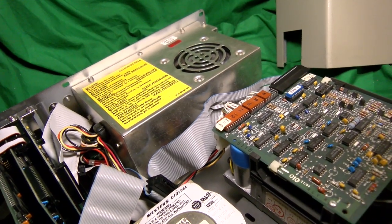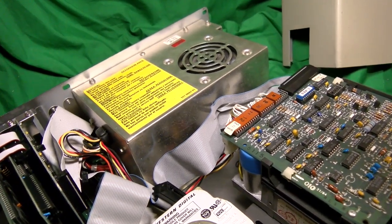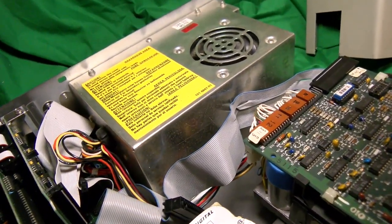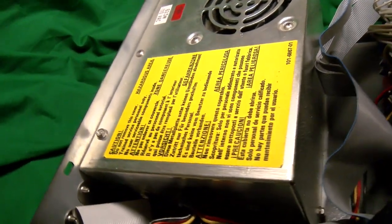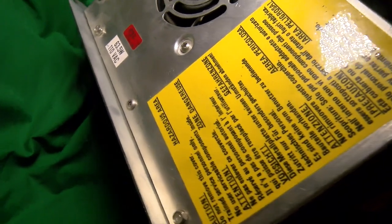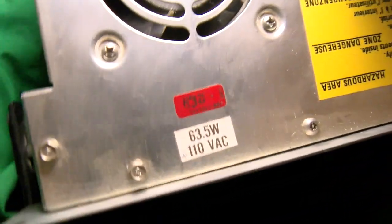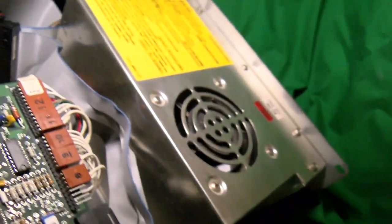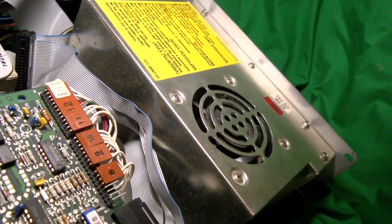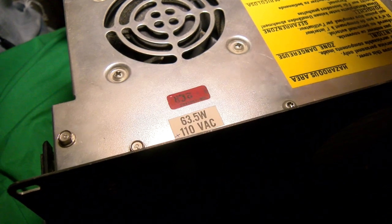And immediately, we're staring at the IBM-style power supply. We didn't get the smaller AT-style power supplies until quite a while after the XT, and I can't remember ever finding out who did them first. As well, we call them AT power supplies, but the IBM 5170, which was the AT, still had a larger one akin to this power supply. That was more powerful though. Well, this one is only a 63 watt unit, like the IBM 5150 had, which is certainly a potential problem.